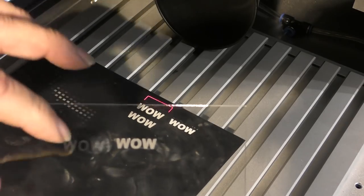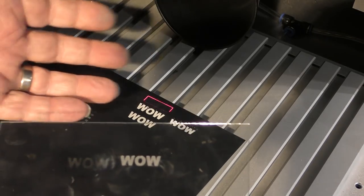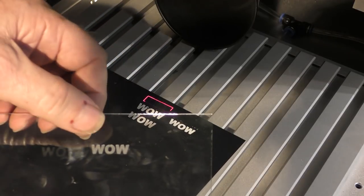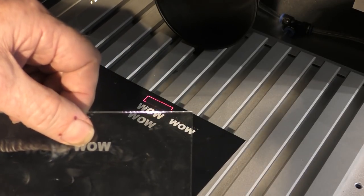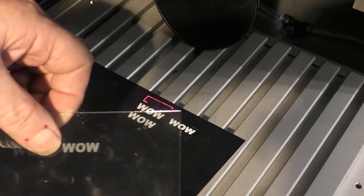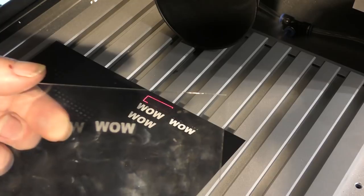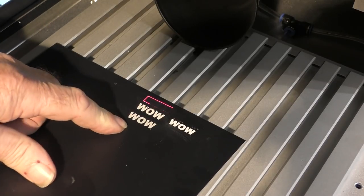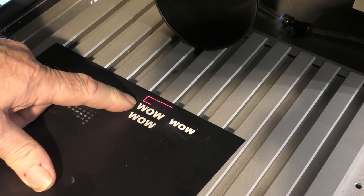Basically, the glass has been completely transparent to infrared light at one micron wavelength, whereas at 10.6 micron wavelength the glass is completely opaque and the damage takes place on the top surface. Here the energy is transferred right through the glass and has damaged the material underneath as though the glass wasn't there. This was without the glass, and this was with the glass. After that little demonstration you may begin to understand that all lasers are not the same.